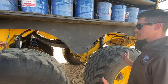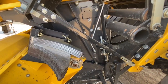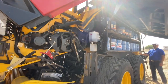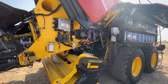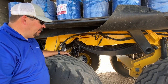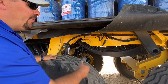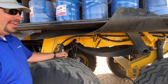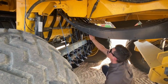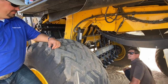The purpose of the hydraulic suspension is mainly for driving in the field. Being able to oscillate hydraulically — as we get heavier and heavier equipment — gives a nice ride, being able to go back and forth between the front and rear tires. That oscillation is hydraulic now. A secondary benefit is the ability to lift the baler up and get accessibility underneath it. You can fit under there without even bending over — it's a good place to have lunch too.